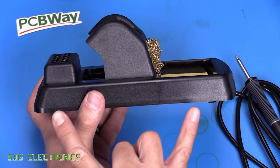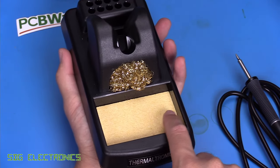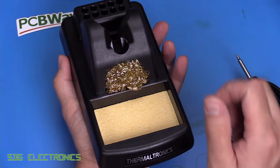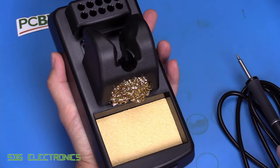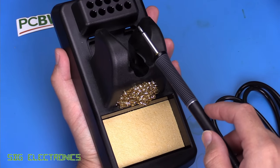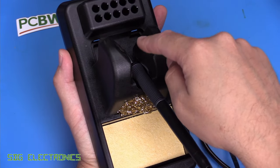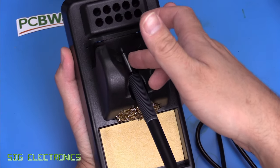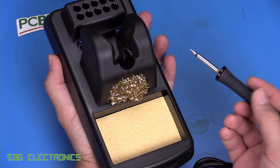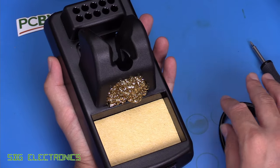Here is the cradle — the first thing to notice is it's actually a really big cradle, goes back a long way and is quite wide. At the front there's an area for the sponge for cleaning the tip and a brass pad for removing heavier oxidation. The handpiece rests in a section with a couple of magnets, which you can feel as you place it. That magnet changes the Curie point of the cartridge and immediately drops the temperature, then the moment you remove it, it heats up rapidly back to operating point — saving tip lifetime.